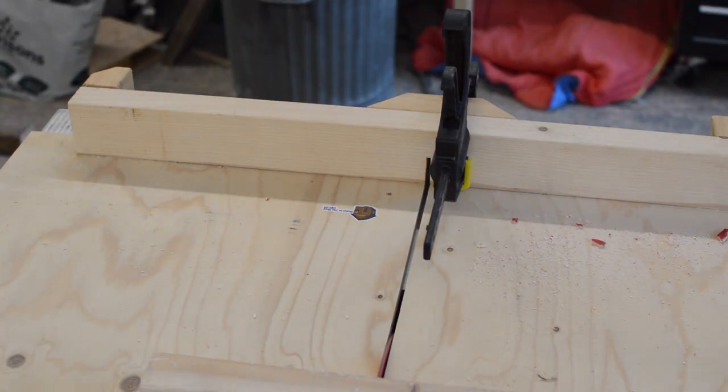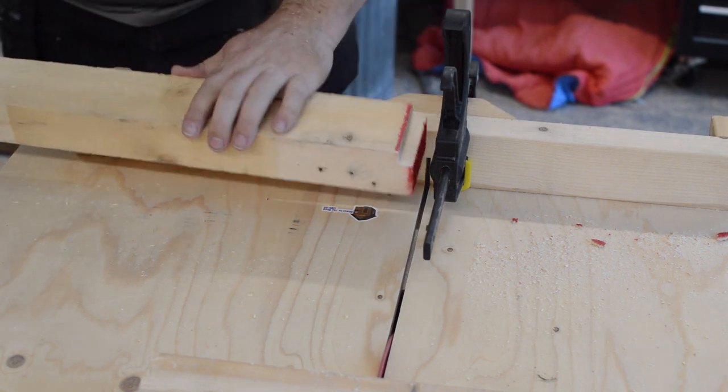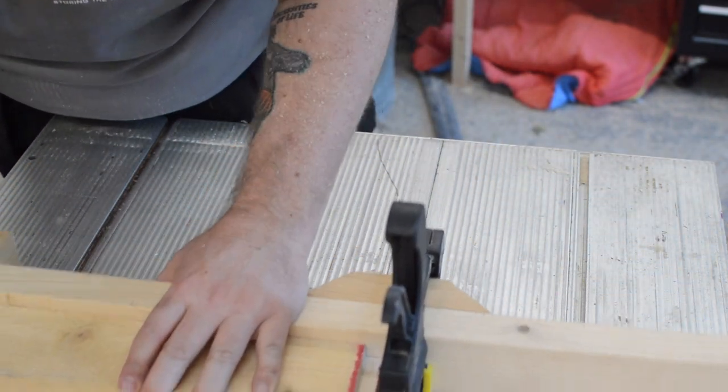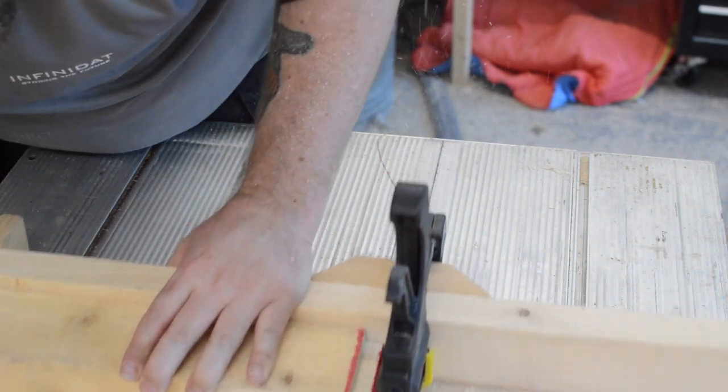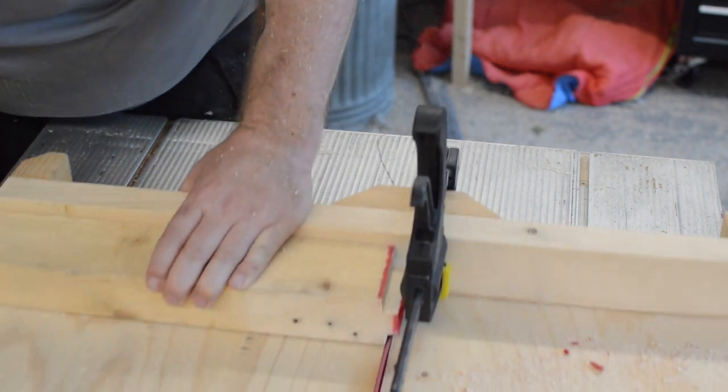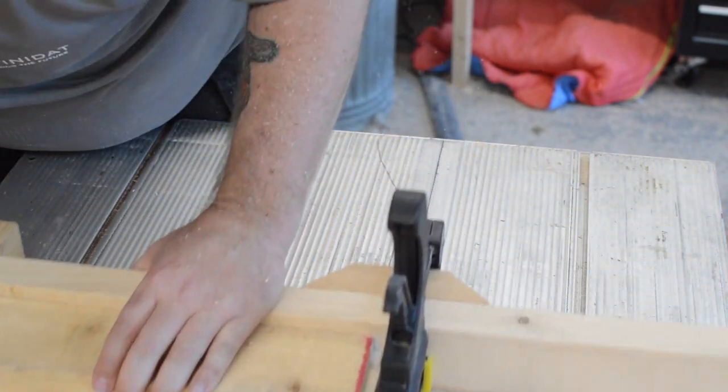As well as the main cross member or stock, there's also a lower support beam which is around 20 inches from the floor. This sits inside the groove that was made on the three layers of the upright. So here I am cutting the shoulders out, so this will just slide into the channel that's been made.